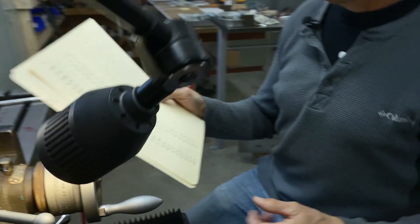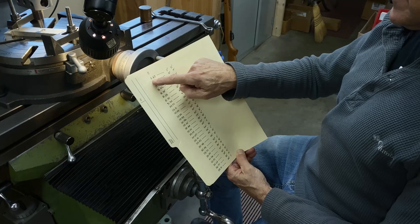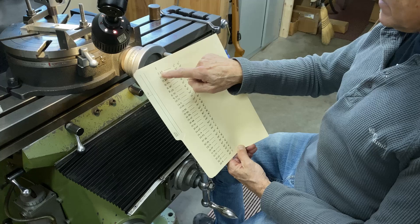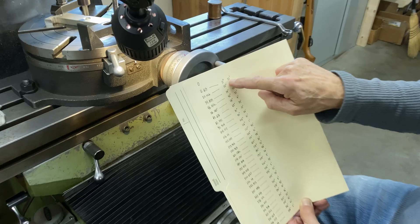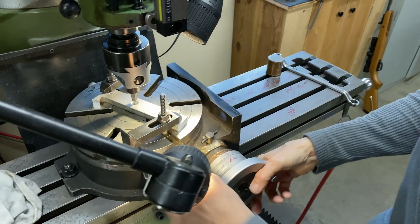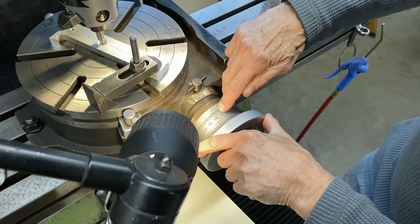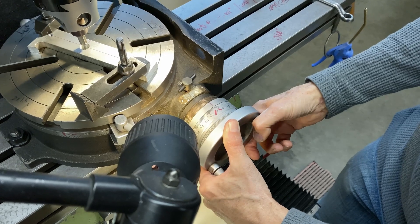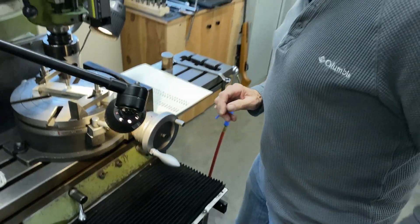I made up a piece of cardboard with all of the cuts I have to take. Each cut is 11.613 degrees. You have to convert that into minutes, so it's 11 degrees, 37 minutes — because on the dial here it's in minutes. You can see how it goes from zero up to 60, 60 is the next number. So you have to dial in degrees and minutes. It's a little bit technical.